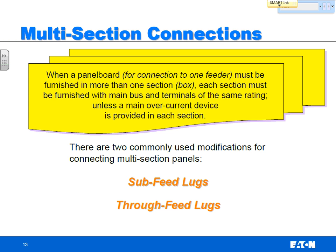The downside that I've always seen is, 21 breakers on each side with 21 wires. There was plenty of room in a panel board for that. But now if you're doubling that and you've got 42 breakers on each side running up the gutters, it can get a little crowded in there. So that's one of the downsides. A lot of times maybe you just want to make the panel board a little wider, which is an option. Standard widths on a panel board are 20 inches wide, but you could get it up to 28 inches wide if you'd like.